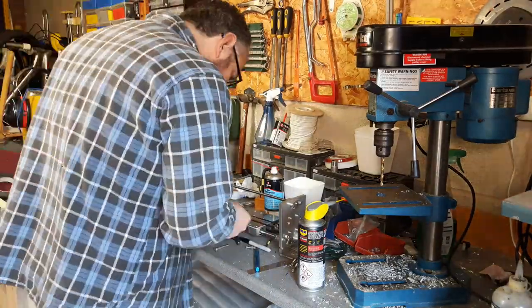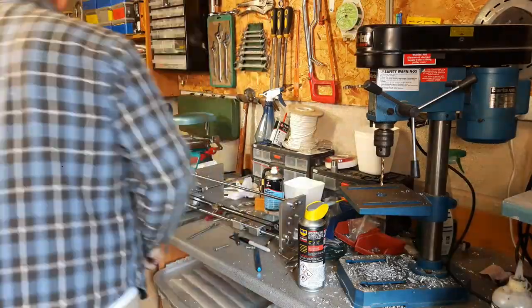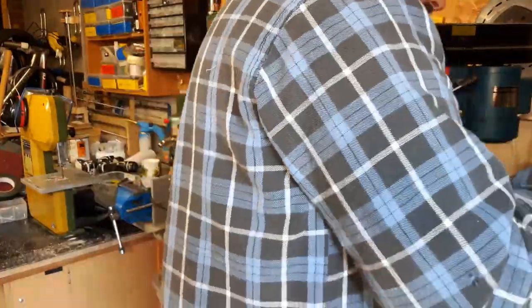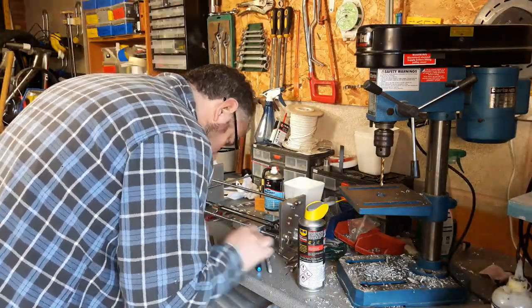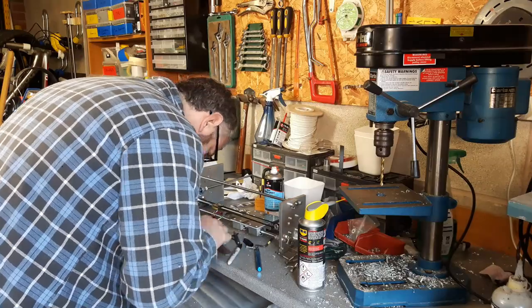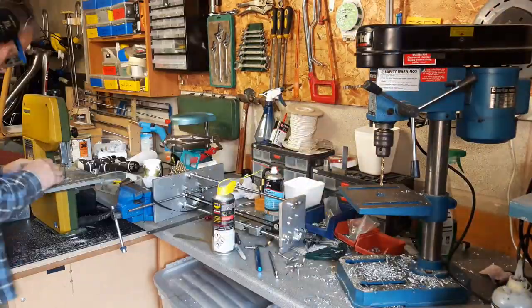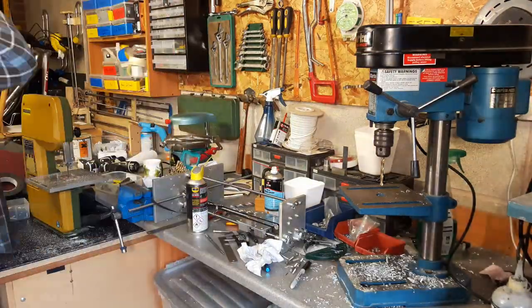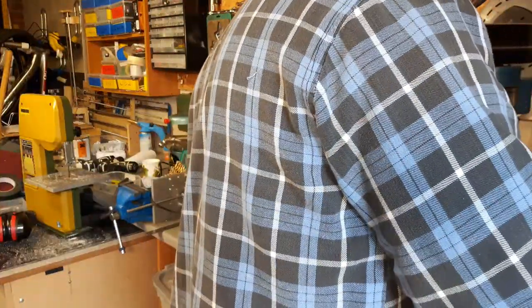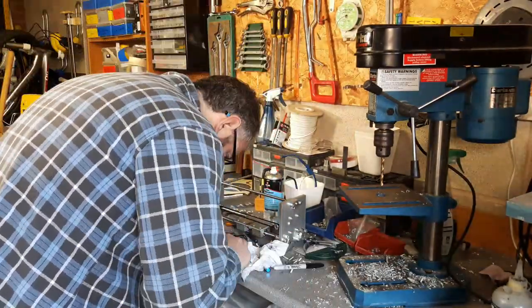Finding that because of the way this is all manually done, I'm having to make the holes bigger than you'd expect just to get all the tolerances in. Now you can see me — I've got the belt in there with a bulldog clip just holding the belt tight. I found some stock aluminium that I've got, and I'm cutting it into little blocks. These are going to be used to fix the belts to the pulley, so I'm just using the sander here to square them up and tidy everything up.